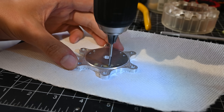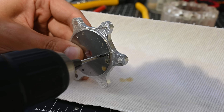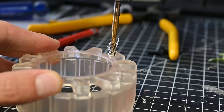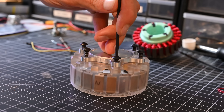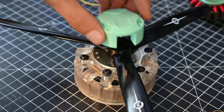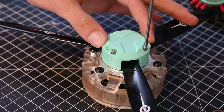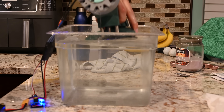The part we machined is going to attach to the front of the motor. If you FDM-print the outer housing, you can use heat stake inserts to attach things, but since I resin-printed the outer housing, I used a tap to create some threaded holes and then attached the plate with M5 bolts. I then added a propeller to this to see how much thrust it can make, and attached it all using a cap and some M3 screws. Everything is now really secure and I'm very happy with how this thing turned out.